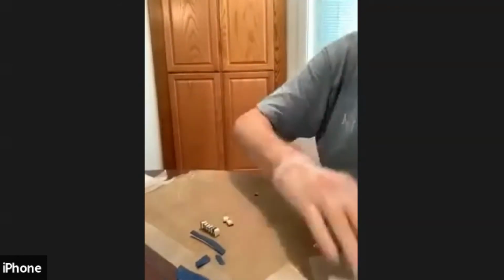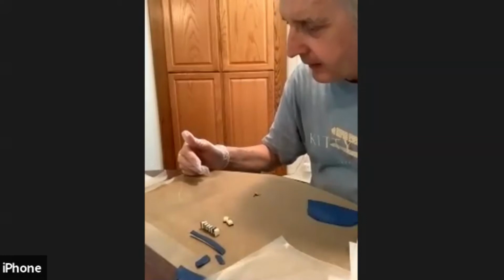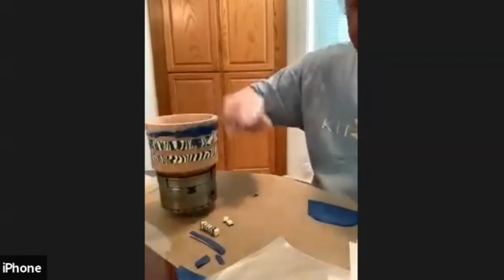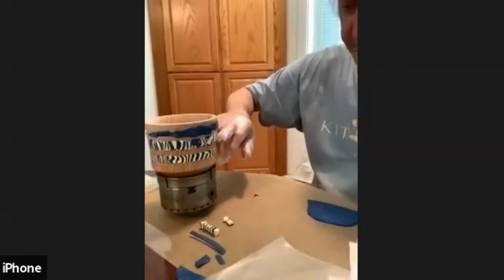So when you turn it, is it a real powder? You getting shavings or powder? You get powder and you do get shavings. I find that using the carbide tool takes it down better, but just a regular sharp bowl gouge works too. I think I used a sharp bowl gouge on these two. Sorry, on this one, not these, because I didn't do this one yet.